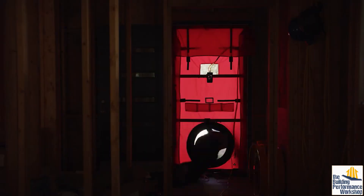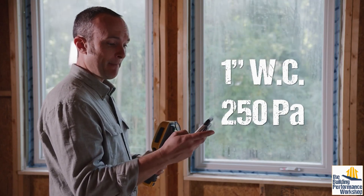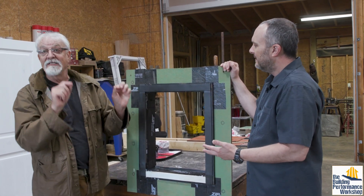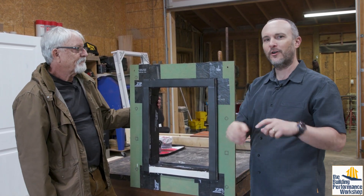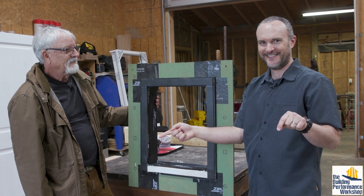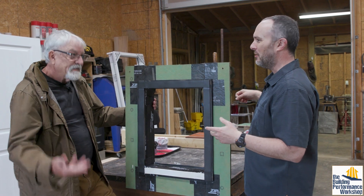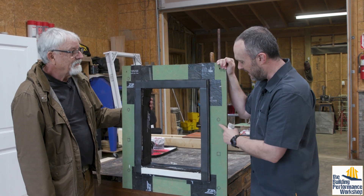You can see the video while doing a blower door: pull a pressure, measure it, then do a water spray and measure what your water spray is. ASTM will tell you what it needs to be. A builder like Landis actually does this in the field — guys in construction are always building jigs, which are not things you want to show your friends but help you build other things. Building a jig to contain a small fan so you can pull on it with a vacuum — that's exactly what's happening here.